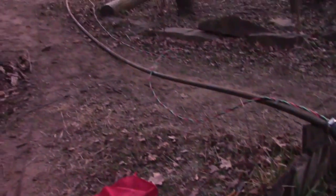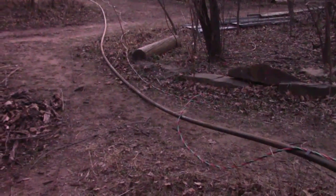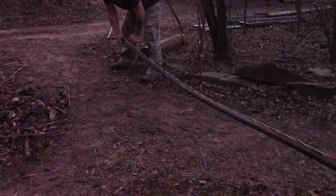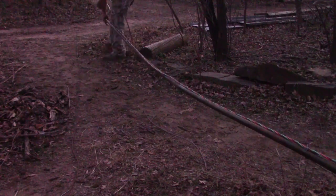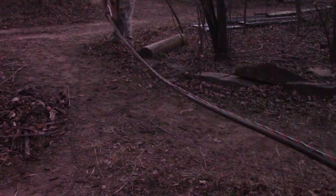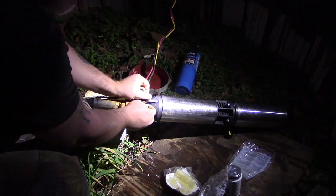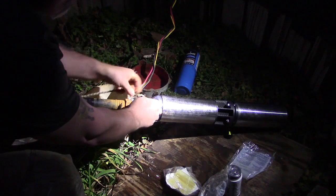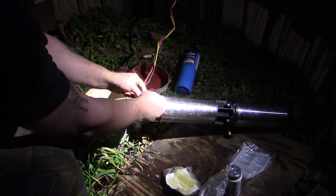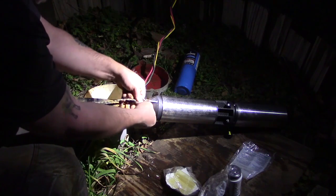At this point I'm going to tape the wiring harness up the length of my drop pipe. Per the instructions, this says to put two wraps of tape every eight to ten feet. I talked to a plumber buddy of mine and he suggested every three to four feet, so I'm going to trust him since he does this every day. Now that my wiring harness is taped up, I'm going to attach one end of my support rope onto the pump itself. Daylight caught me, so we'll be filming the rest using a flashlight.